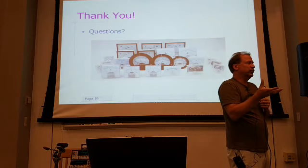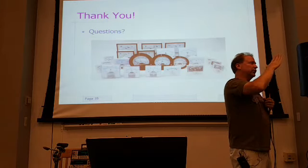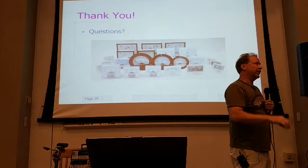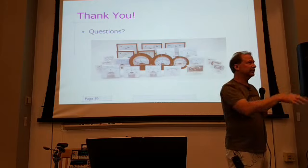So when you're using analog meter movements, you always want to try to use them so that the meter is close to full scale. It's going to give you the highest, most accurate readings, relatively speaking. Make sense? Was there another question?